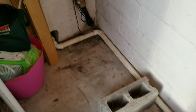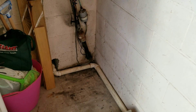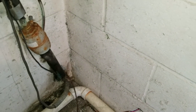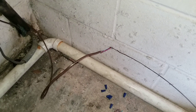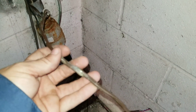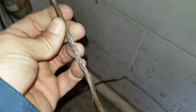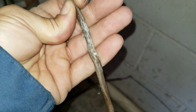I've cleaned out this shed as much as I could to try to get this repair knocked out, so wish me luck. Alright — after some choice words and some tugging, we did get a new wire through using a fish tape. I had to cut that junction splice off outside just to pull it back in. Here's one section — you can see it was smashed pretty flat, but I don't see any nicks or openings in the wire.